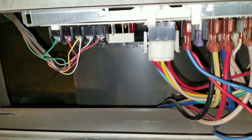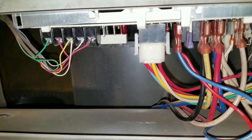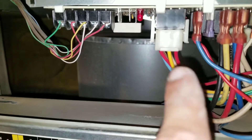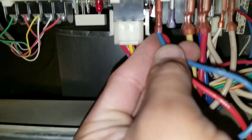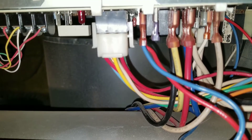If you came up here and saw that your board's LED light was not flashing, you would check the 120 volts coming in and check your circuit breaker. But if you didn't have power at your board, that would indicate that you have a bad or faulty transformer. As far as testing my transformer, everything seems to check out.